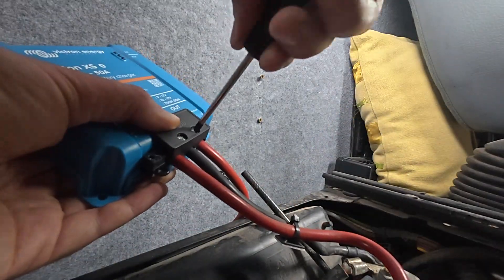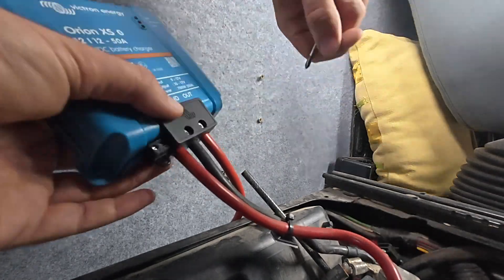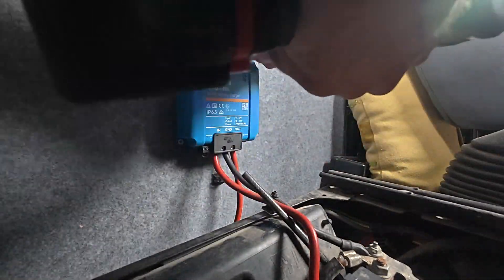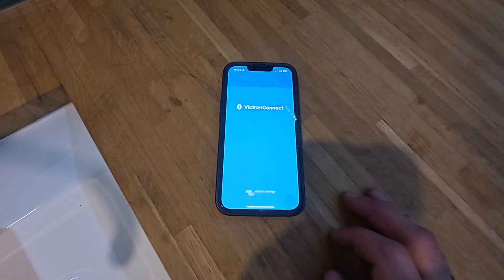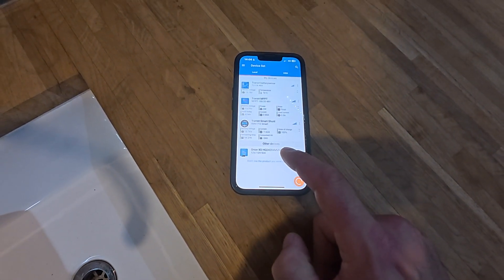I've inserted all three conductors with the copper shortened down, and now I'm going to mount it on the wall. When putting the plastic cover back on, please be careful — the screws are stainless steel and if you tighten them too much the head will strip out, and you'll have difficulty releasing the terminals in future.